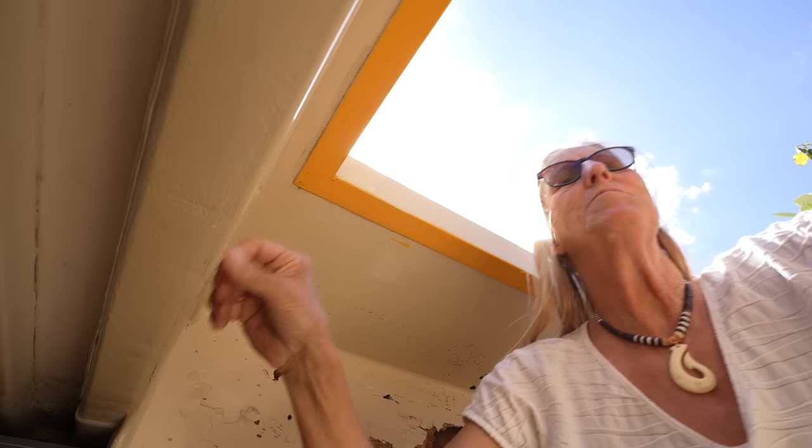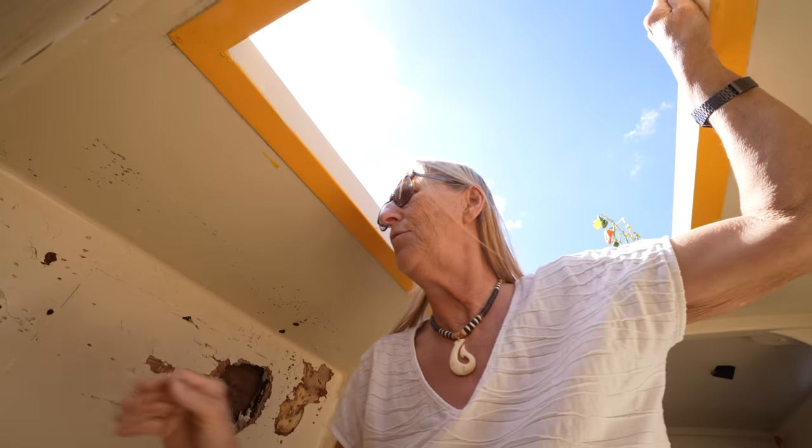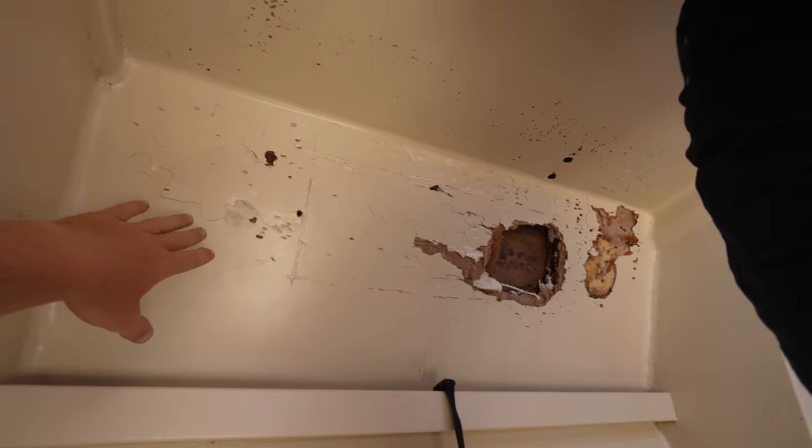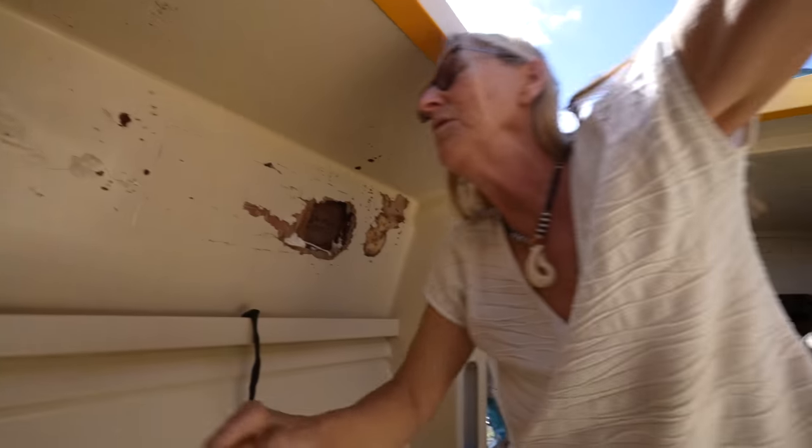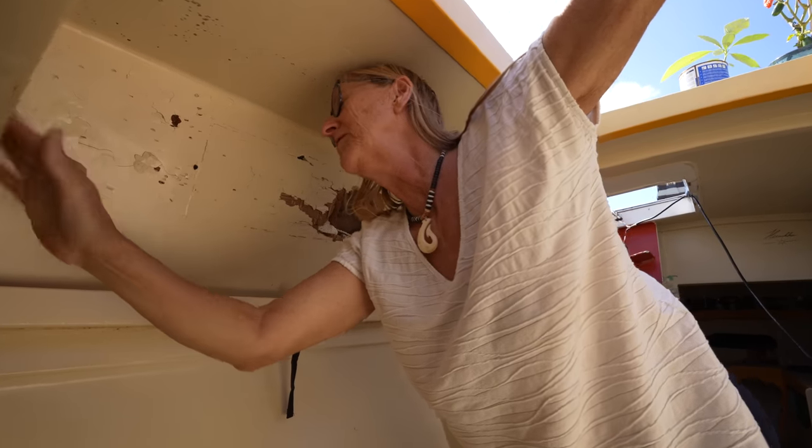This side is all right. It all feels good. You can sand it out a bit. Yeah, I'll pull the paint off, but I wouldn't worry at the moment. It's nothing critical now. I don't think so, because that plywood sounds good from the other side. It's just one layer. I think maybe the moisture has spread from here. This all feels firm. It doesn't sound at all rotten, actually. And the glass is all in good condition on this side. So I wouldn't worry about it. One day you can just sand this back and fill it a bit so it looks nicer.